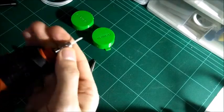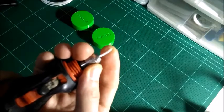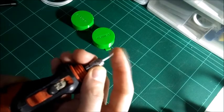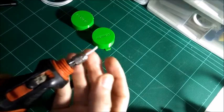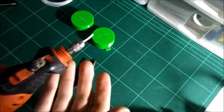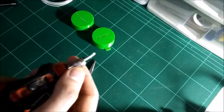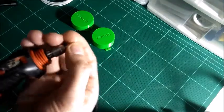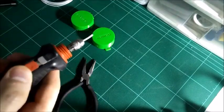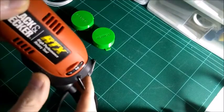Tighten it down, and you're going to want to try to get this filament to be as straight as possible, because when it spins, if it's curved, you're not going to be able to get the filament to spin on a single spot. A little bit of offset is sometimes good — as you practice with friction welding you'll get a feel for it, and a little bit of offset actually helps make a better bead along your joints. But just try to get it as straight as possible.